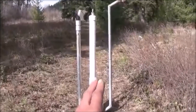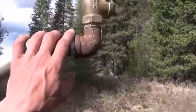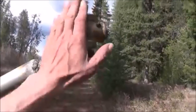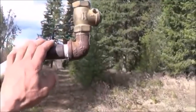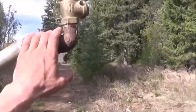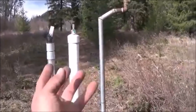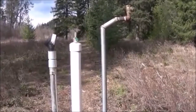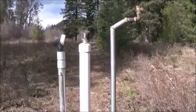One of the added things at the end of this that we're going to do, once I get a couple more of these one-way valves, is up here at the top — like I said, this will all be buried in the ground — I'm going to extend this out and put a full water ram right here. So we'll have another one of these tanks sitting off of a T right here going up, we'll put our water output here, extend to another one-way valve, just like the water ram video. That way we can get both compressed air and pumped water out of this system. In the end we can use this as both designs at once — pump water and get compressed air — two forms of either energy output, a stored source of power, or gardening use, or whatever we want from this.